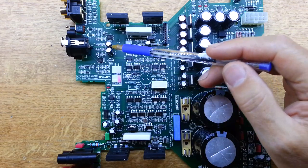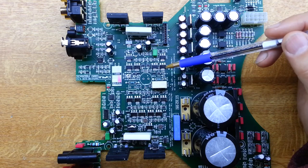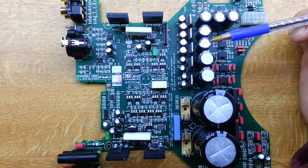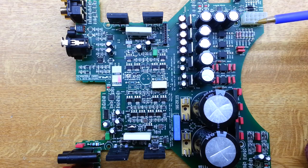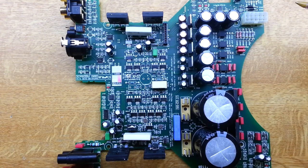The capacitors that were removed have been replaced with wire links in some areas. There are other areas where parts have been swapped and some values changed. So there's a bunch of changes on the board beyond the little extension board we're adding. All of these capacitors have also been replaced with higher temperature parts, and the board has been cleaned — it's looking very fresh now. We just have to wait for the little adapter board before we can complete the installation.